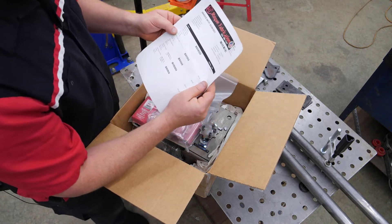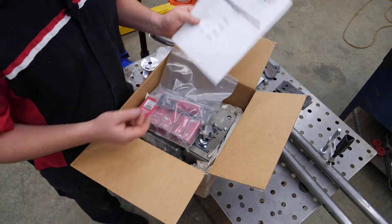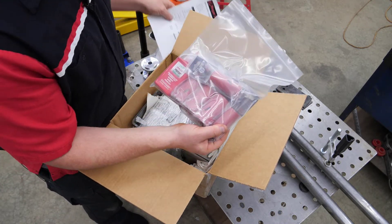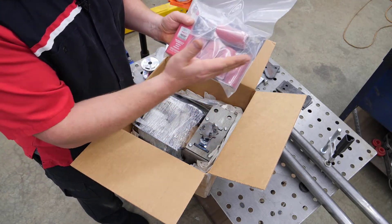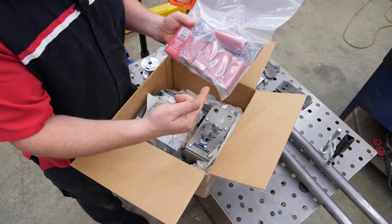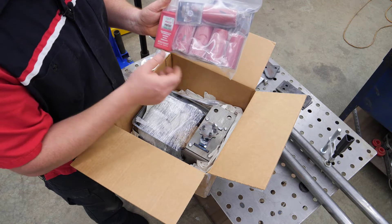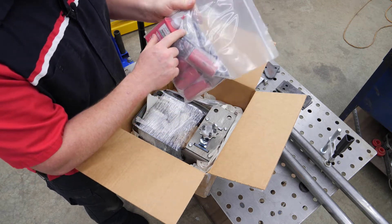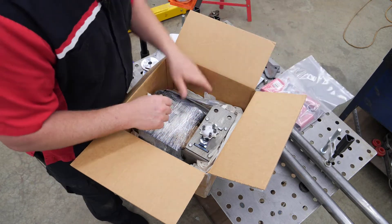This is the Versa Notcher Pro Kit, and I got the extra deep hole saws — that's what these are. So you can actually cut at 45-degree angles without having to back out and cut that notch that's halfway out. I got the extra deep, came with some Tap Magic cutting oil, and in there as well are the arbors. I'll show you why that's important here in a moment.